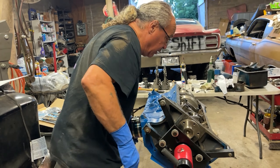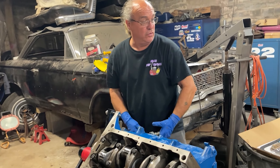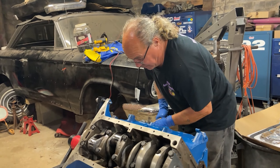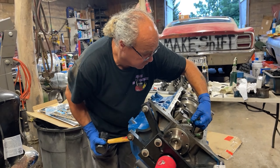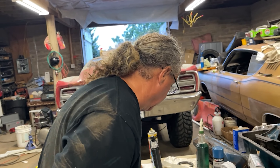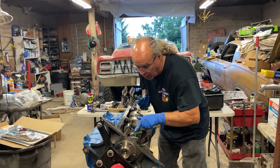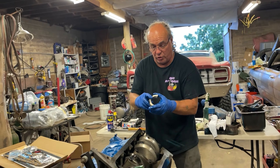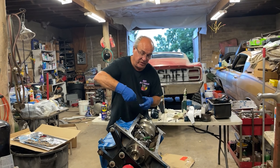What I like to do is use the butt of the hammer to just tap it in. And there you have it — four slid in. Beautiful. Again, you have number four facing out to the outside of the motor, and then you have to make sure your cap is the same way. Four on four, facing out.